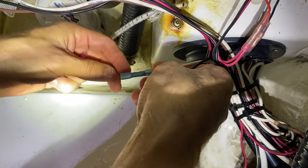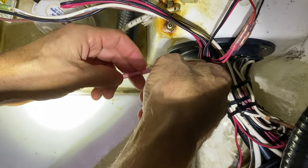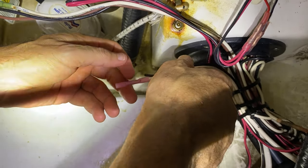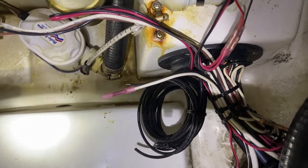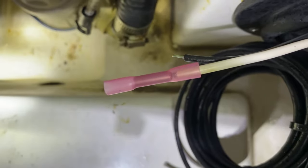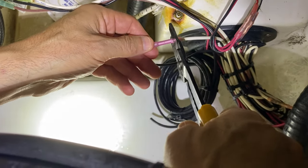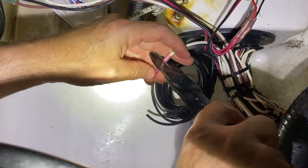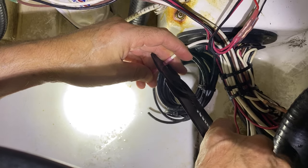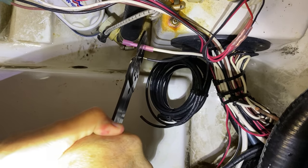These red things we're putting on here are butt connectors. What we're going to do is put the exposed metal wire inside on both ends. Electrical current will run through there. We'll pinch the ends so they're watertight with the crimping tool, then use the heat gun to make sure they are nice and snug around the wire so absolutely no water, moisture, or humidity can affect the connection.